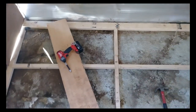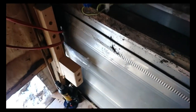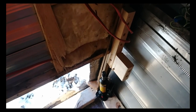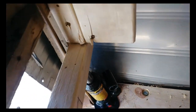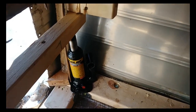Another quick update - the reason this corner was bowed out so bad is because when the wood rotted out down here, the wall actually sunk. So what I did to correct the issue is made this fun little thing and just used a bottle jack to kind of get it into position, and then took a nice long board and used a little leverage to lift it up.